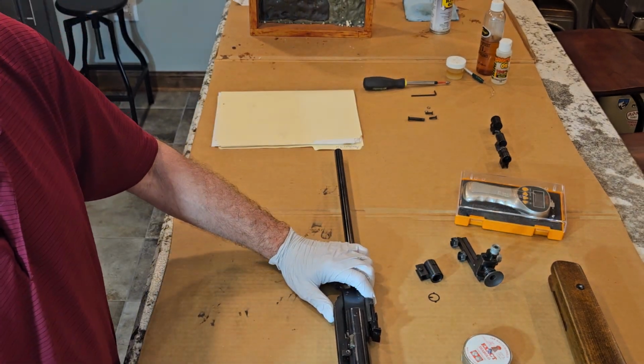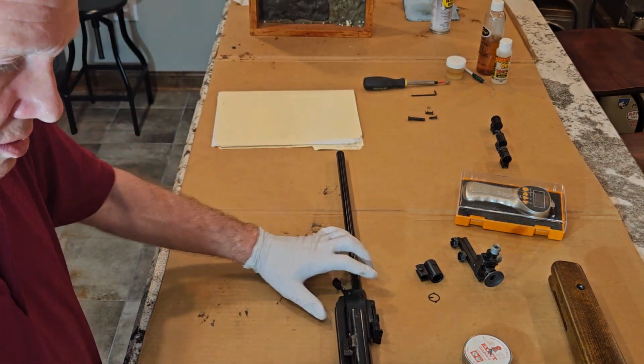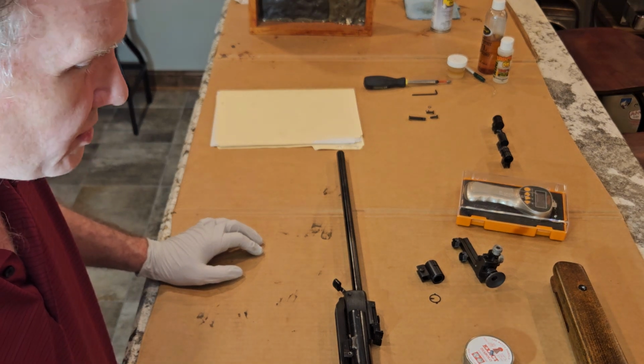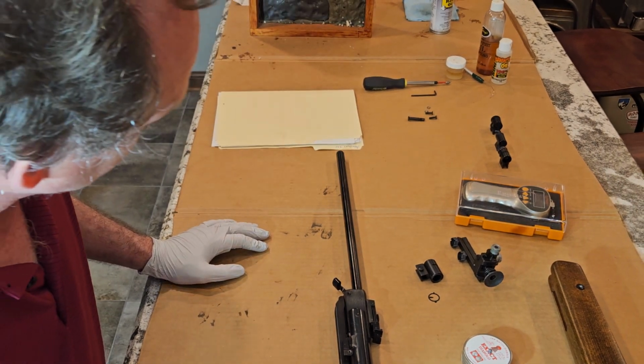Once it was adjusted to be not so light that it didn't have a second stage, otherwise, it goes through a little bit of a movement in the first stage. It hits a stop, and then at about 2 pounds 2.3 ounces, it breaks cleanly.